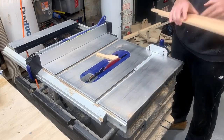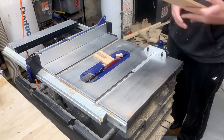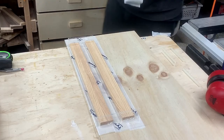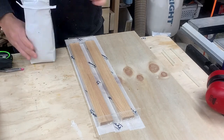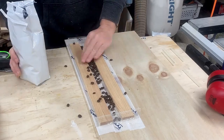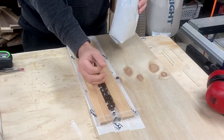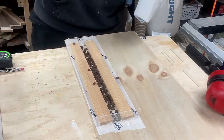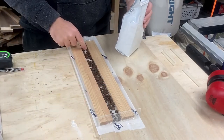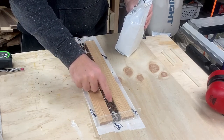Then over at the table saw, I squared up both ends using a miter gauge. I also ripped the piece down into two equal width strips. I covered a section of plywood with Tyvek tape, then cut two sections of plexiglass for each end and glued them in place with a hot glue gun. Then I hot glued down the length of each strip to lock them in place and create a seal. I made sure all the corners are sealed — it's very important that there aren't any gaps, otherwise the epoxy will leak out.